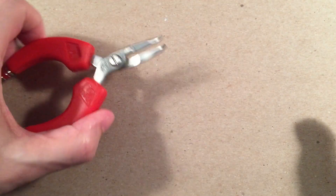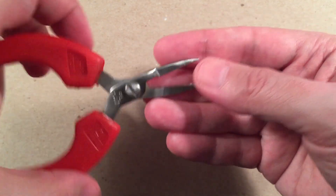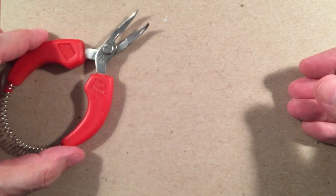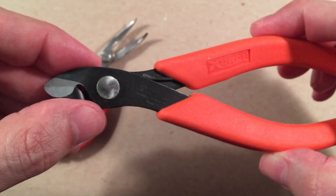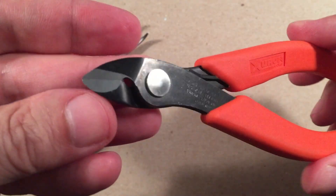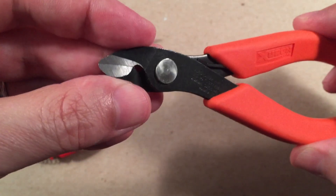For tools, I like to use diagonal pliers to bend the legs if you want — I use my hands, but a lot of people prefer the tool; just be careful with the pressure. These flush cutters are really nice for cutting off component legs. It's a Xuron brand, made in USA — these will last you forever. Just make sure you're cutting soft component legs; don't cut anything stainless steel or it'll ruin the cutters.